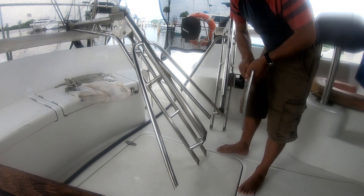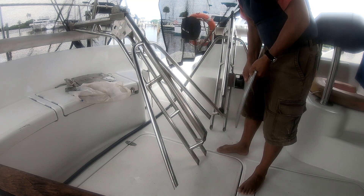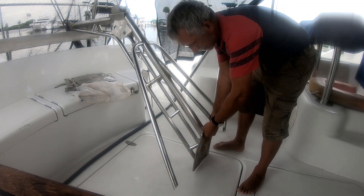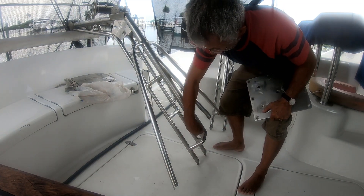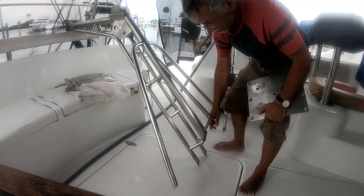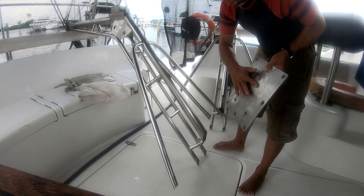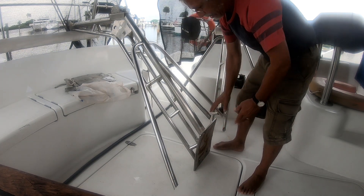When I got it back over here and hung it up on the back with lines and ropes to get a feel for it, it was still leaning into the water. It also didn't line up exactly with the plate — close, but not a perfect lineup. So I went with a marker and cut my offsets as I saw fit, took off quite a bit off the top so it would tilt up, cut from back here, cleaned out the welds, matched it up, and hung it back on the transom the way you see it right there with the plate.